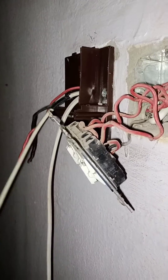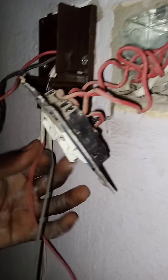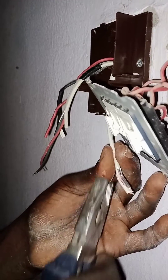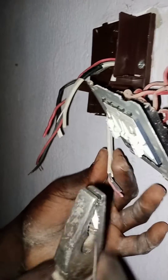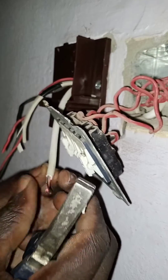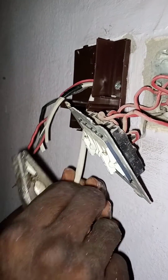It comes with the remote control. We are opening the control box to do the necessary connections. As you can see, we previously passed the wires through the ceiling, and this is the outlet where we're installing the control. We are using two wires, and at this junction you have to be very careful as an installer — don't mix up anything here, as you could burn the fan.